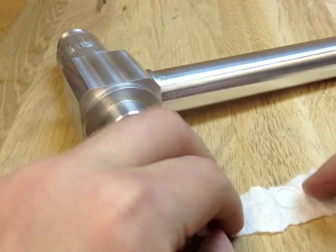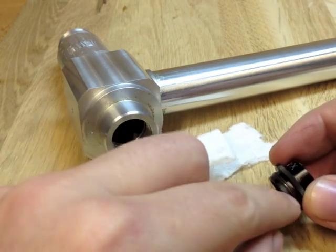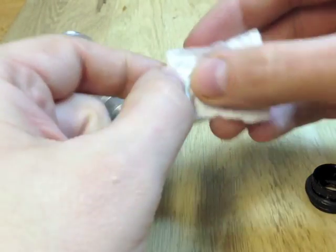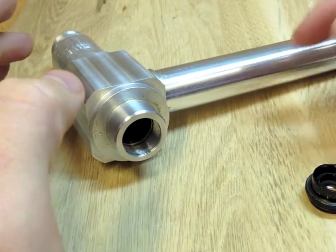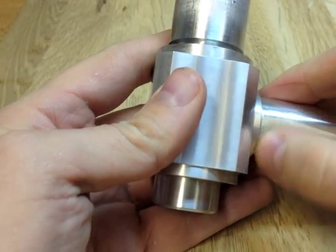I might still make my own objective ultimately. You can imagine to turn that into that would take a fair degree of fiddling about. You need to make the body, a true seating for it, and a ring to hold it down with equal pressure — and you still don't want to cant the lens over to one side. Quite a bit of faffing about to get something like that made well. This is the eyepiece tube. As you can see, it's a bit grimy and there's a bit of excess Loctite there.